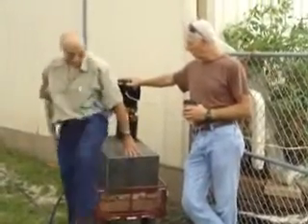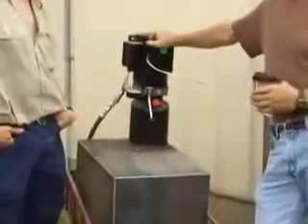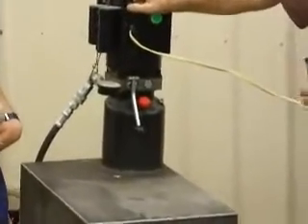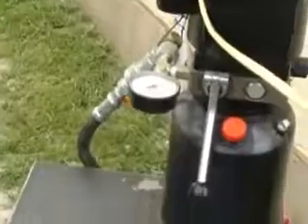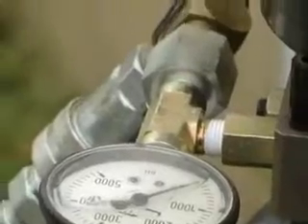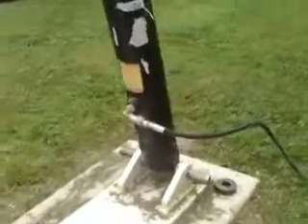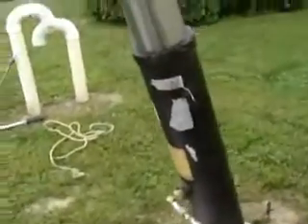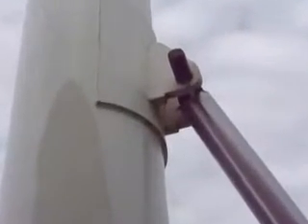Tom's sitting on the hydraulic power unit that contains the hydraulic oil that goes into the single-action cylinder. The system is capable of 4,000 to 5,000 psi, even though we only use about half to two-thirds of that in the lift. When we go to lower it, we really don't need the pump — we just use it for the valving because it's a one-way cylinder. You can see the hydraulic jack in blue on the side; that tips us over center. Then the big black cylinder, similar to what's on a dump truck, catches it after it gets over center a bit, and we just slowly let off the pressure to let the tower come down onto the support systems for maintenance.